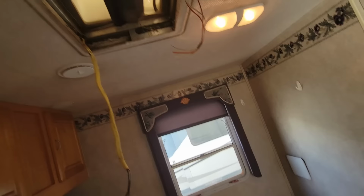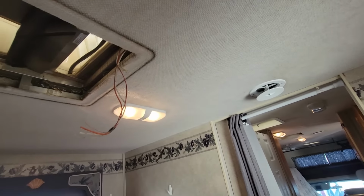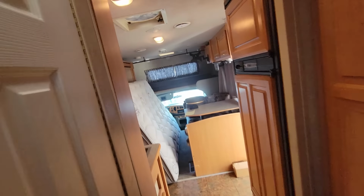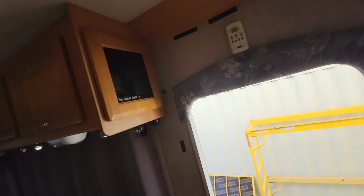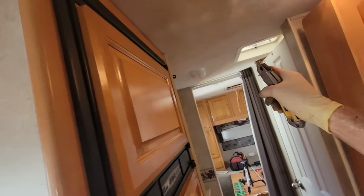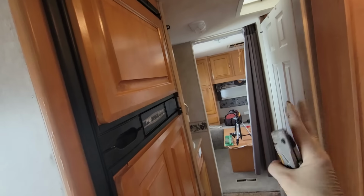Now before I get on the roof, change out the unit, and start building the plenum right here, I have to decide where I'm going to put the thermostat. Because this is a retrofit, I'm going to be limited on where I can put it. I mean, it'd be nice to put it on the wall like right about there, but even though the remote was right there, that's not really the thermostat. The temperature sending unit was at the AC unit itself at the return air. So that was kind of the best place to put one.